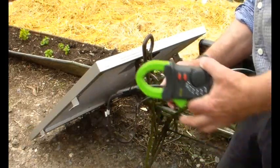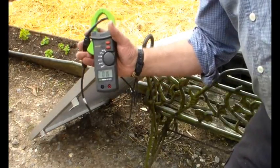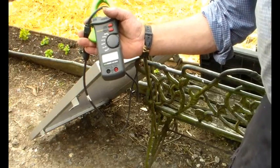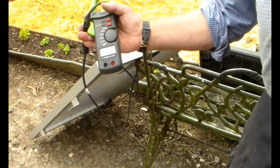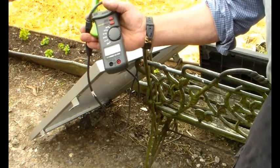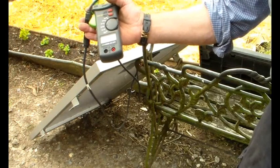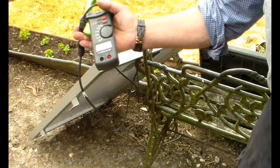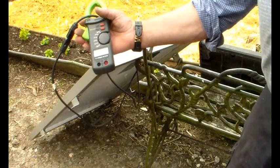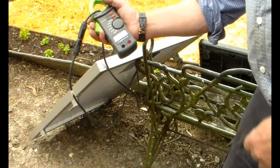I'm going to spray some cleaner in each connector just to make sure everything's connected properly. I've got the panels off the roof and I've shorted the outputs — and you can see that's 1.7 amps. I went round them all and initially got some bad results, then cleaned the contacts and the sockets and we're getting much better. Even in this light level we would be getting 4 times 1.6, so that's at least six to six and a half amps as a short circuit current. Each panel is actually generating, so the bypass diodes are all right.